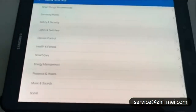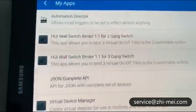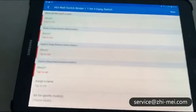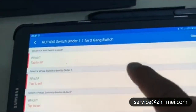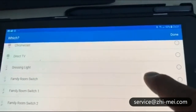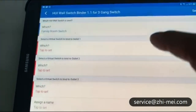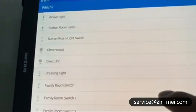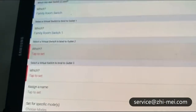Add a smart app, go down and say 'my apps', and it should show you the UI wall switch binder 3-gang switch. Click on that — it'll ask questions. Which switch do you use to start with? Click on that and it'll ask you to select the actual physical switch. In this case, the family room switch is the physical switch. Select that, then bind each of the three sub-switches to each virtual switch — first virtual switch bind to family room virtual switch one, second bind it accordingly.